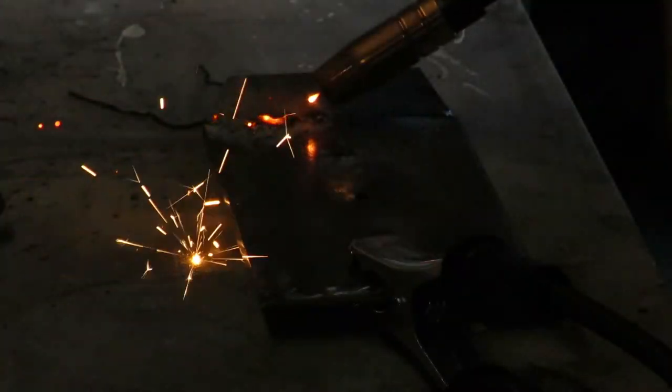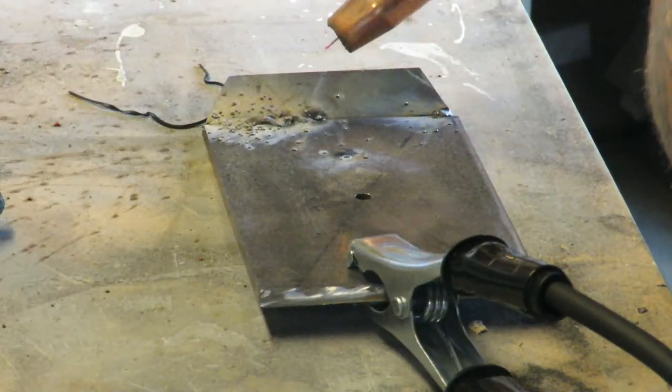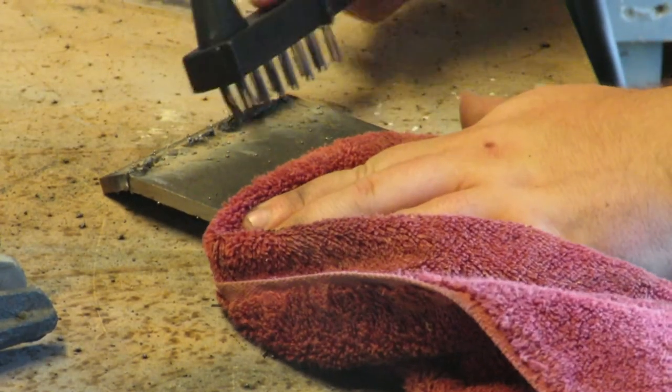After this session of welding, I talked to my buddy, who was a professional welder for 30 plus years. He said that the splatter I was getting was due to the wire I was using. Apparently, flux core wire, which is what I'm using, doesn't burn as clean, and that's why it has the splatter effect.